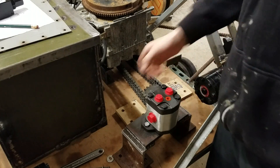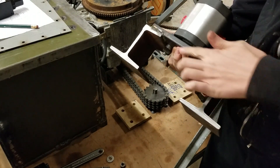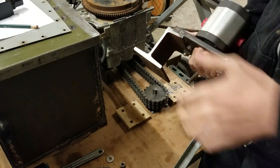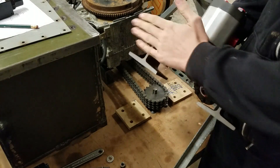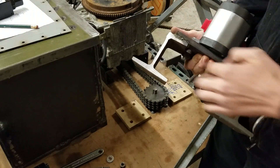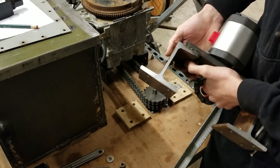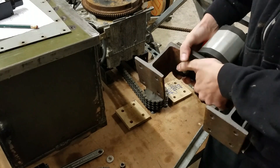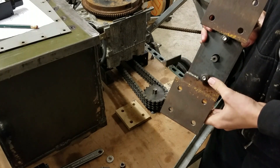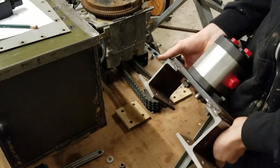I got this thing apart. I'll start with this bracket here. In the last video I showed you this top plate — I had made that and had the pump bolted onto there nice and solid. After that I cut two pieces of four-inch I-beam and welded them onto there. I also cut off the other half of the top part up here — it wasn't really necessary but I figured it looked better. Then I drilled four holes — seven-sixteenths bolt holes, four on each side — giving a nice solid fixture into the bottom, with the pump bolted on nice and solid.